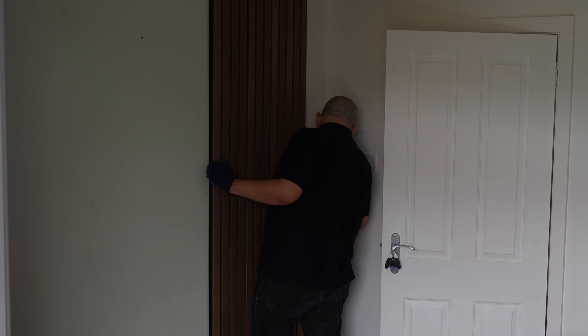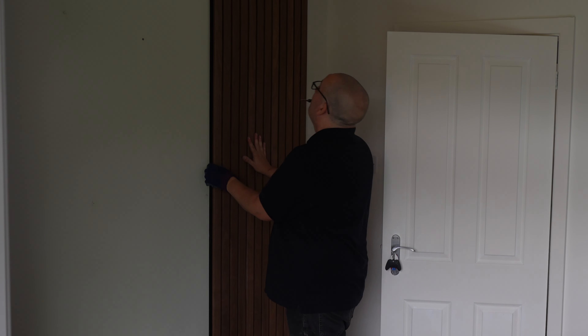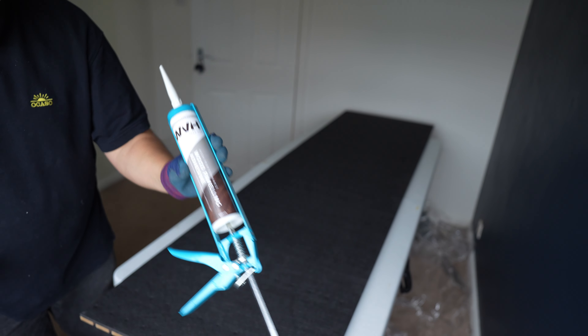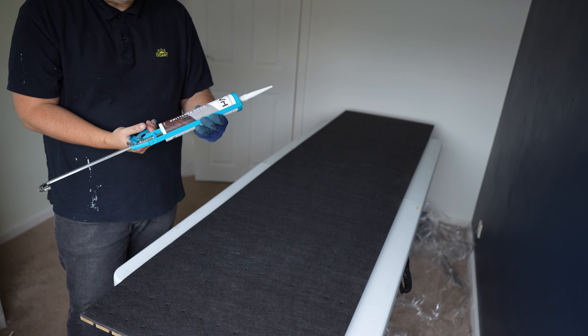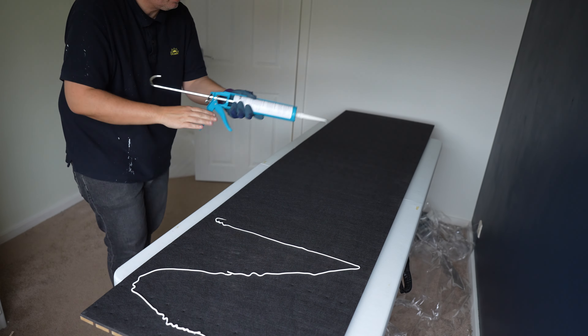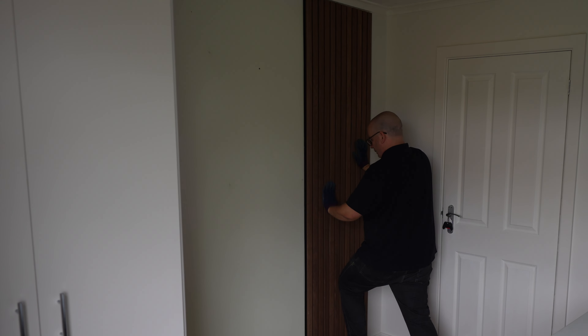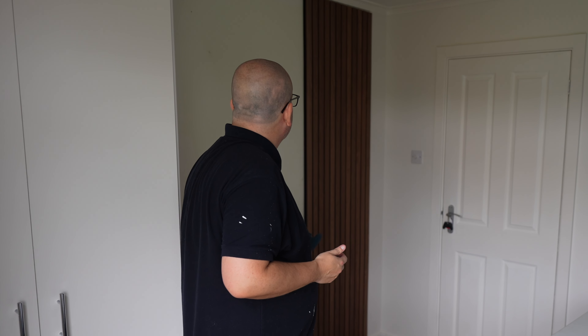Now it's time to offer this up to the wall before I put the adhesive on. I'm happy with that, so now I'm going to apply the adhesive and get the panel stuck to the wall. This is the wood paneling adhesive from Wood Veneer Hub — it says high instant grab, ultra high strength, hazardous free. That first panel is now in place. It's probably the most important one because if it's not square, none of them will be — and it looks pretty much square to me.